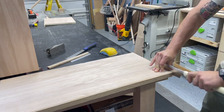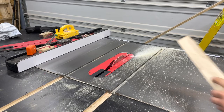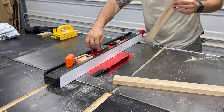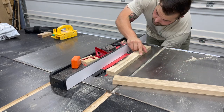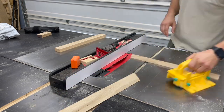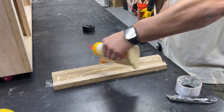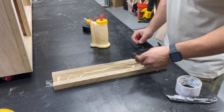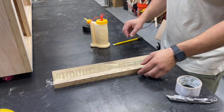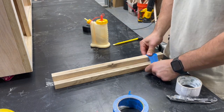We decided to keep it super simple for the base — I'm just going to be making six solid white oak feet. First thing is ripping a 45-degree miter down the edge of both sides, which is going to allow us to hide any seams and give it a cleaner look overall. To glue this up, I'm using a piece of clear packing tape on the bottom to make sure that miter is closed up nice and tight, and then spreading some glue in the joint and using blue packing tape to hold it shut on itself. You don't need anything too crazy here — tape is all you really need.